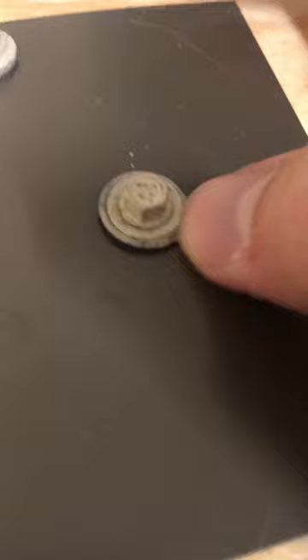You're going to get moisture all around that screw hole, so this screw is done — that one's no good. We're going to replace it and I'm going to show you what you should do. Anytime you're installing metal roofing screws, you should set the torque on your drill like I just did. Check that out — now I've got it set so that when I screw this next screw in, it's only going to go so far.